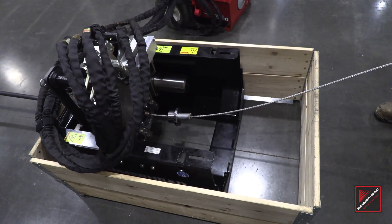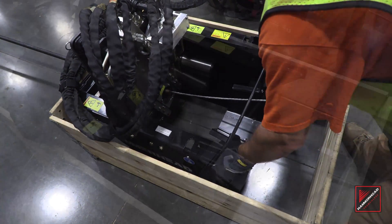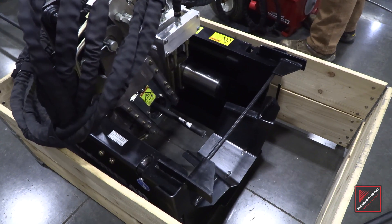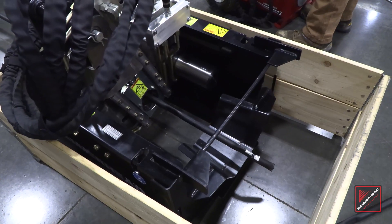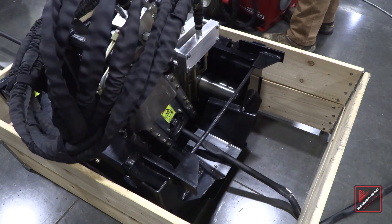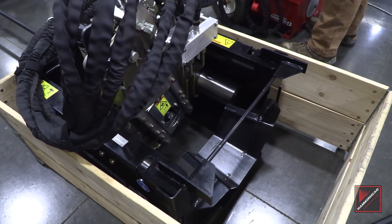Remove the bungee frame. Remove the chuck assembly and the chuck pocket. Install the drop chute. Stroke the machine to make a pull. Open jaws and return carriage to the front of the machine. Activate the shears with the jaws open and the carriage at the rear of the machine. Shears can be activated at any length desired. Clamp and pull. Repeat process until extraction is complete.